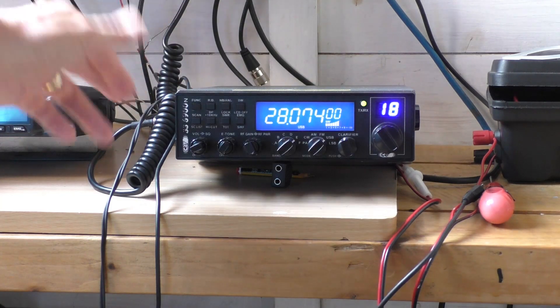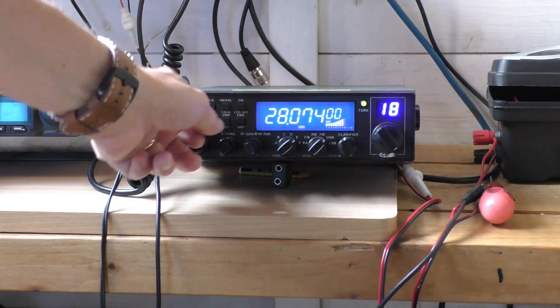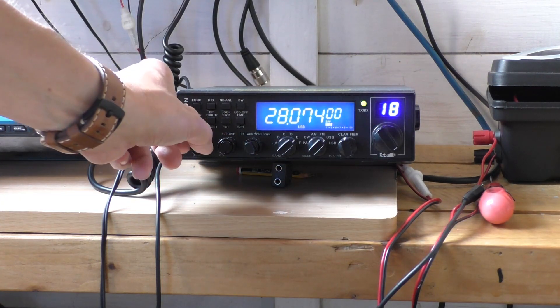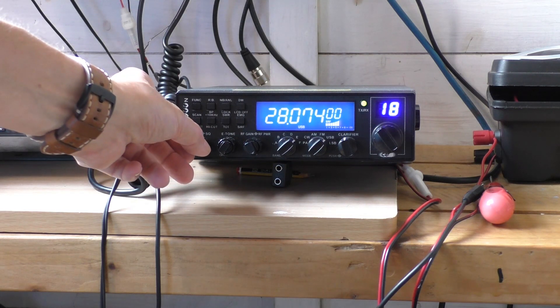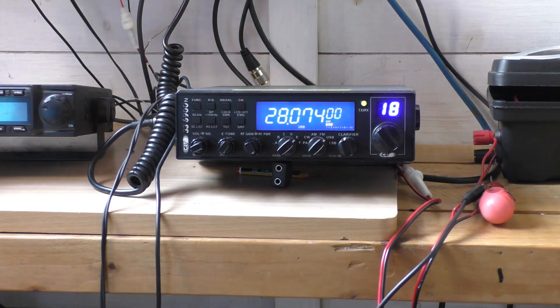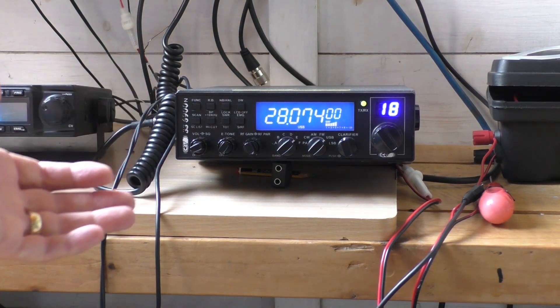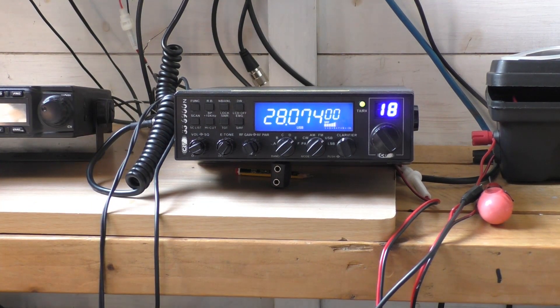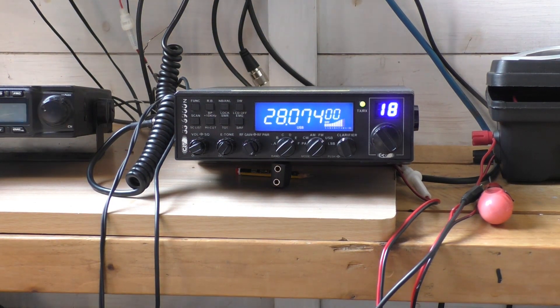If you tune up to 28074 — it might come out as 75 on channel 18 — you'll pick up this really strange, quite tuneful noise coming through. I knew this was going to be some kind of weak signal data. I thought originally it was probably going to be JT65, so I did a video to ask the guys and girls, and they came back and said no Fred, that is FT8 — it's definitely a weak signal data mode.